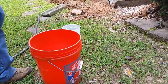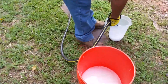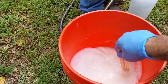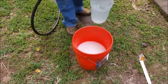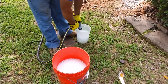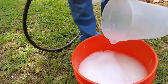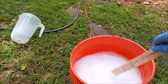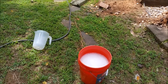Because we used 4 gallons, and it's 4 gallons per 10 feet, we're going to add more water. You have to mix it very, very thoroughly. You can see it becomes a white substance. Put another two gallons — one gallon and another gallon. Keep mixing — mixing is the most important step. Mix the substance as much as you can. The substance has a white color. That's 4 gallons of Termidor ready to go to the area.